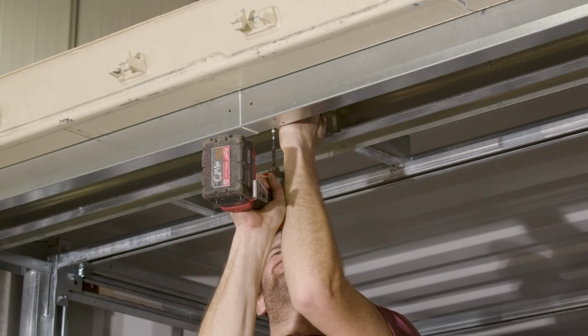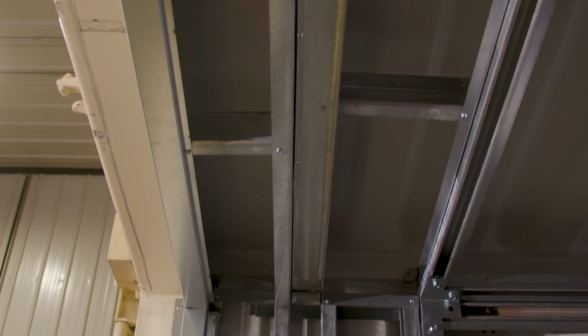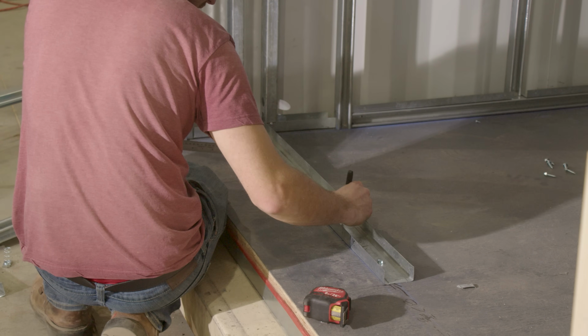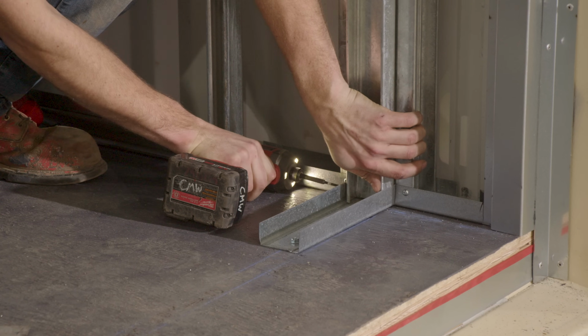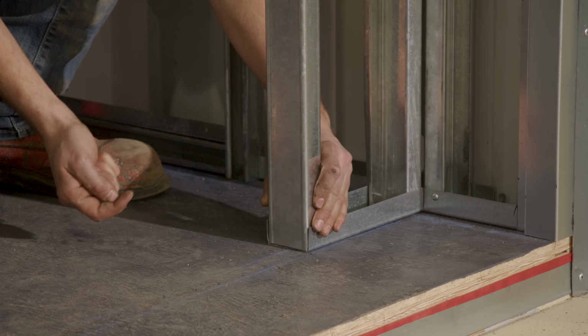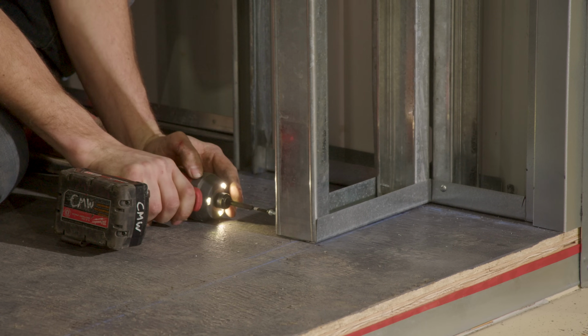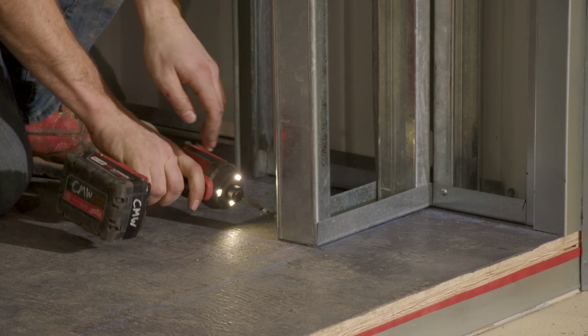On the walls, we make sure that our strut strapping is on the identical plane as our steel studs, so we can transition from steel stud to strut to steel stud to strut, and this new method that we're coming up with might be a hybrid of both. Steel studding is just like wood framing, except you kind of piece it all together like Lego rather than air nailing everything together and carrying the wall in.